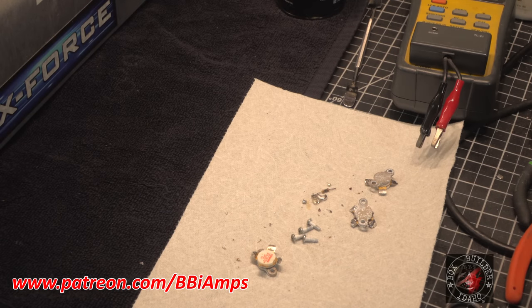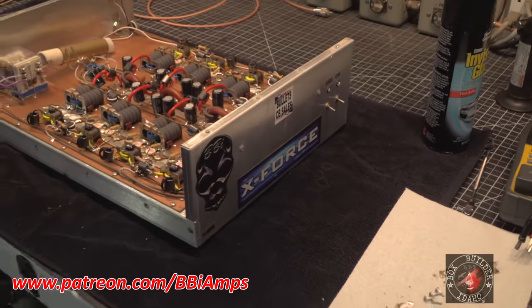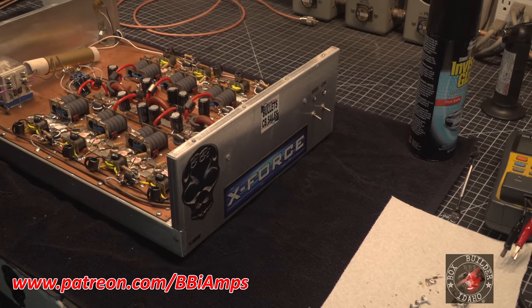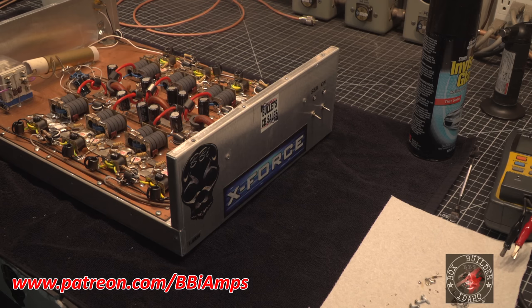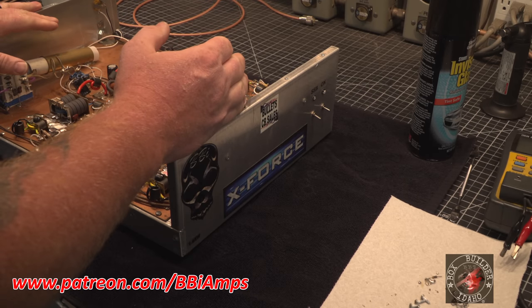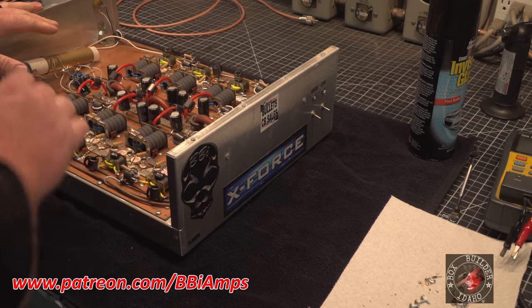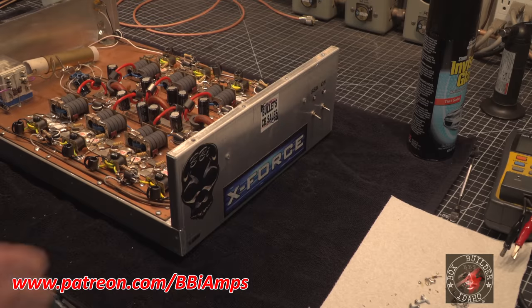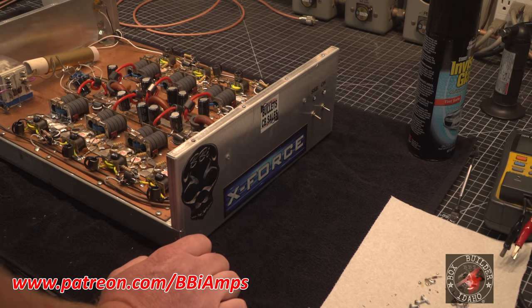All right, well, our next step is we're gonna give this old Blue Label a bath, get the pill pockets cleaned out really well, find us some matching transistors to drop back in these holes. We'll get our 10 ohm replaced. We're gonna put our 100 ohm resistors back in here. We're gonna rebuild the combiner network. And then we're gonna run it.